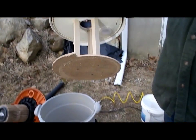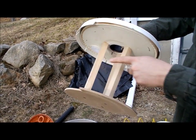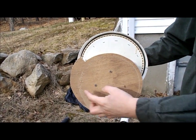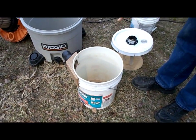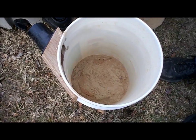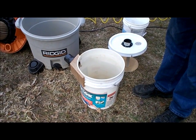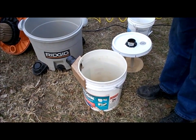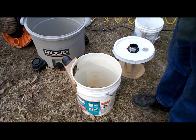Basically, if we lift it up — I don't know how well this is going to show on the video — but there's a little bit of a veneer of dust on some parts of the wooden posts. There was a little bit of dust on the top of the baffle, and a fair amount collected on the bottom. Inside the five-gallon pail, there's a little bit of a pattern of how the dust seemed to separate, maybe in relationship to the vortex. I've also noticed that the fine dust somehow seems to separate on top of the coarse dust, almost indicating that when running the baffle and the vacuum, a lot of the fine dust stays in separation until the very end.